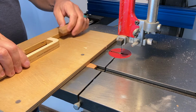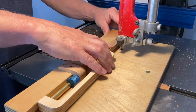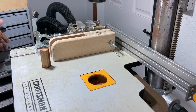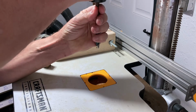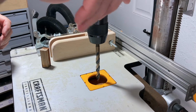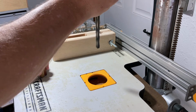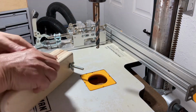Now it's time to use my special jig to cut this blank down to the right size. This is a Viceroy kit, and I'll be using a 27/64 drill bit so that I can put the correct size hole in the blank for my tube. Just a nice habit for myself, I always like to make sure my drill press is set so that it will go through the blank completely, and I turn it on before I drill to make sure my drill bit is straight and I don't get a wobbly hole.